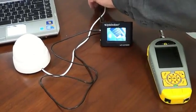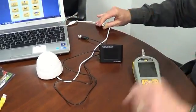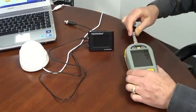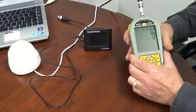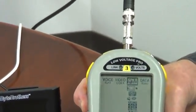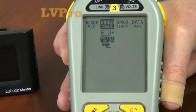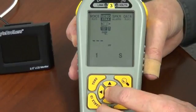Let me unplug the monitor. We'll put on this little BNC-to-BNC adapter — we're into another BNC adapter over here. You can get all of these adapters separately, because the Low Voltage Pro comes standard with an F connector. Let's go ahead and cursor over to video cables. We could do the length and cable test at another time, but at this point let's go down to the camera icon.